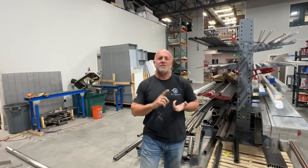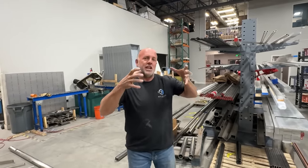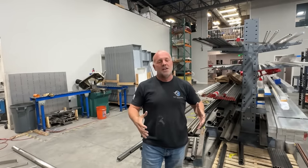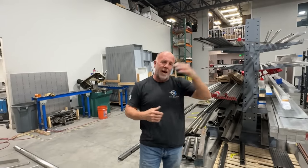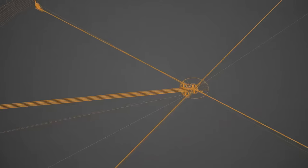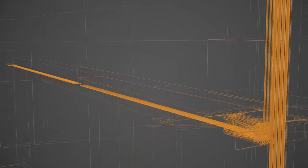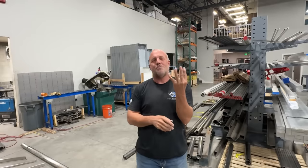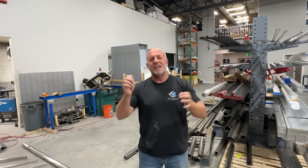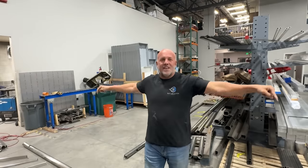I don't think I want to use any type of bearings or anything that needs maintenance. So I'll probably machine some Garolite and some tracks that grab a hold of this ladder on both sides of the pool and keep it clocked and from drifting. If you've seen some of the other videos, you can see how that works. And some of you even asked, why would you use four cables instead of three? Because three tends to keep all the tensions more even. It's actually because of this guide system.